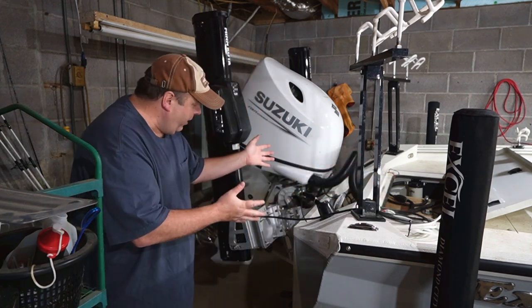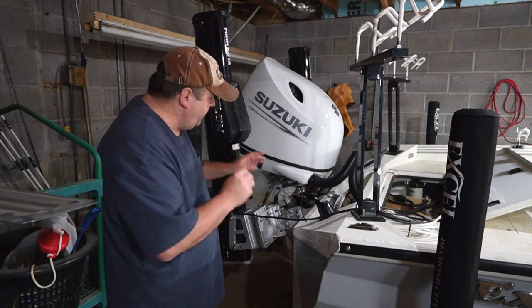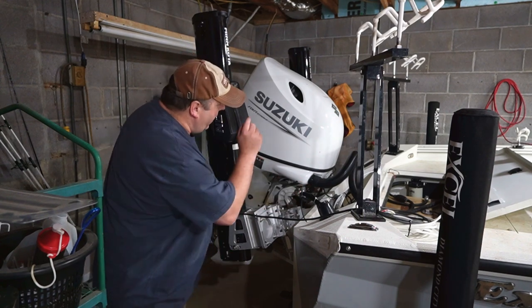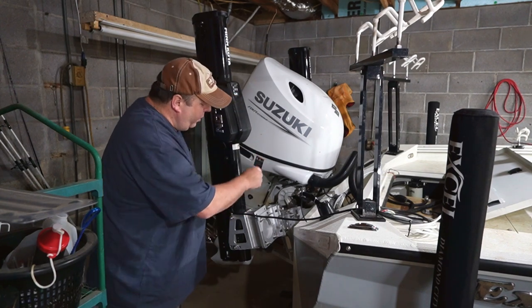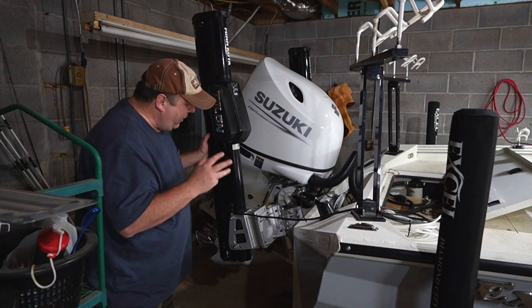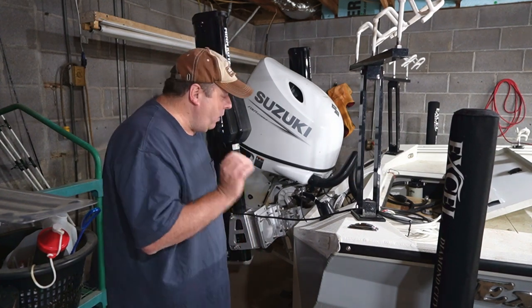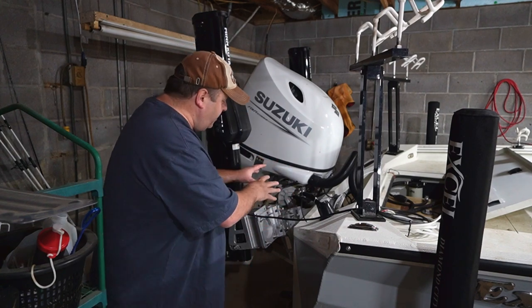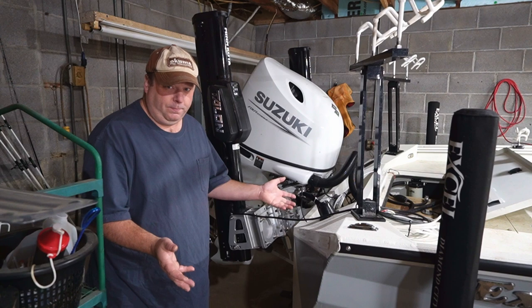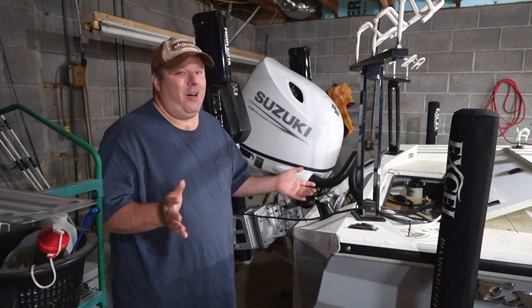The main part is done and boy oh boy, this is solid as a rock. This jack plate is rated for a 175 horsepower motor. Right now I have a 140 horsepower motor and two brackets that weigh 20 pounds each, plus the Talons themselves which I think weigh 20 to 30 pounds each. I will have to look up what the heaviest 175 horsepower motor weighs, but I'm sure all of this is less than that outboard. If you think I've got too much on this transom and jack plate, just let me know in the comments. I've seen other people do the same setup with an Excel Bay Pro 203.